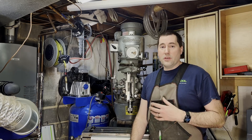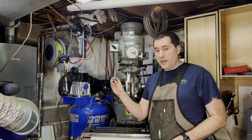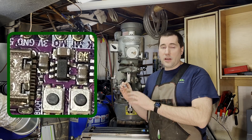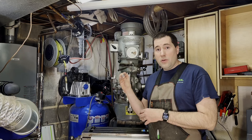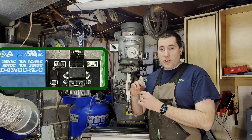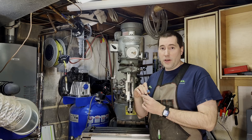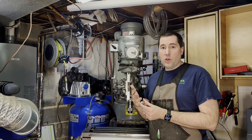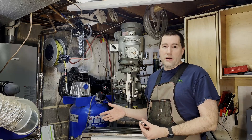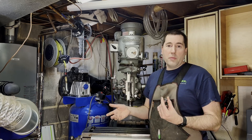So I finally decided I need to figure out something to fix that. What I'm going to do is use this little microcontroller called the CutiePie — it's an ESP32 based microcontroller. It's got Wi-Fi on it and a couple analog and digital outputs. So I can use this along with this little relay to control the ball valve. I'm going to wire the same switch into this microcontroller first, and then have the controller say: if the valve has been open for more than two hours, close the valve. He's probably done, he's probably forgotten about it — we'll close the valve. Next time I'll have to turn it off and on again and it'll open back up.